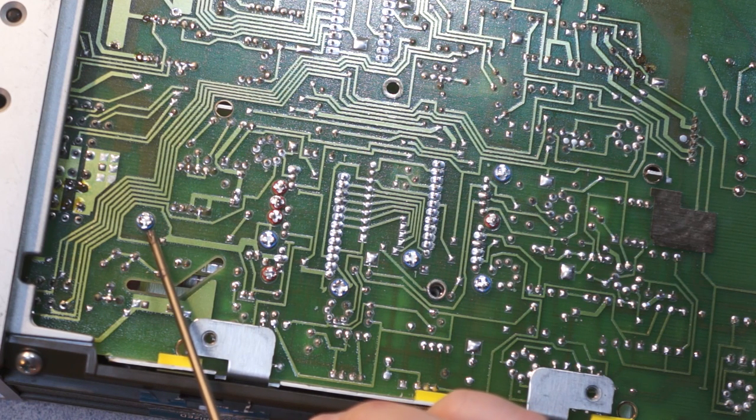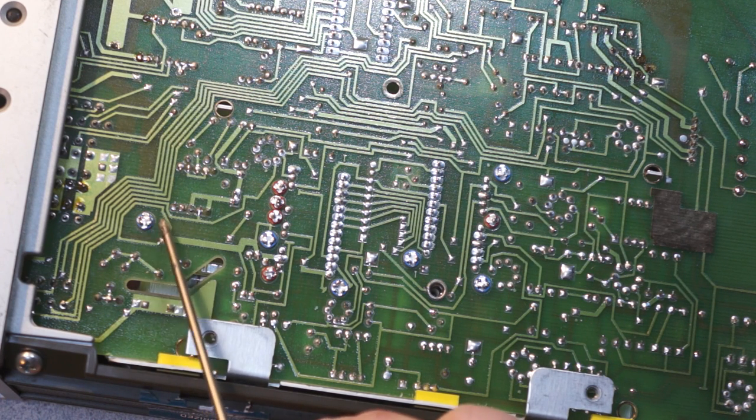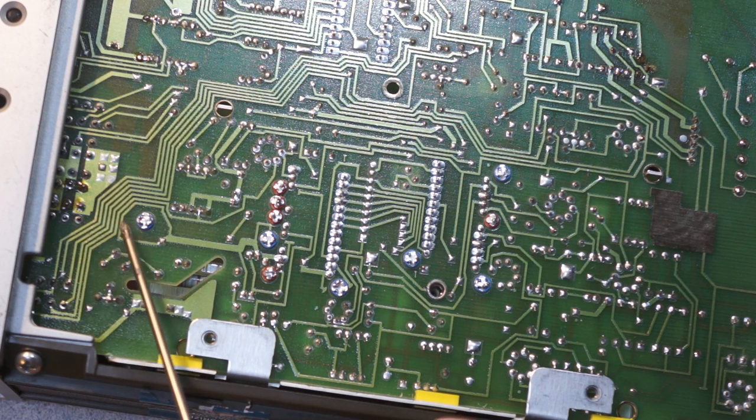But when you need even higher impedances that aren't achievable like that, the common thing to do is use little plastic or Teflon inserts in the board, and that basically gives you a much better insulator to hold this up. And then what we'll see on the other side is fly wires. Basically they'll solder the wire to this tab, and then they'll solder a resistor to it and run that over to the leg of a part that's been also lifted, stuff like that.